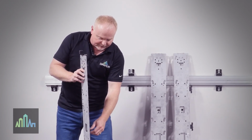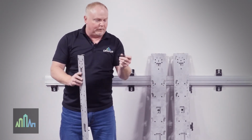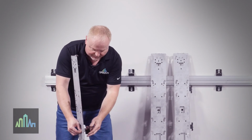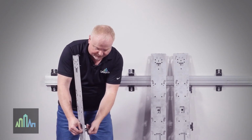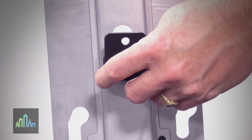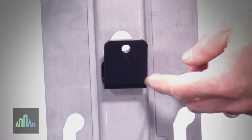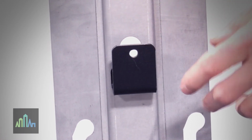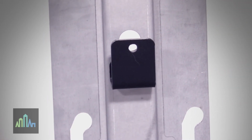You're going to screw it down till just having a couple threads left on the first section of that screw. Then you're going to take the actual bracket and you're going to screw it on counterclockwise. And then once you get it started, it can spin on and be on as much as it can be on. This same Z-axis bracket should be turned upward. As you can see, the U shape is going up. That allows the hole in the actual vertical rail to line up with the hole in this bracket, so you have a push-pull ability on adjustment for this bracket.